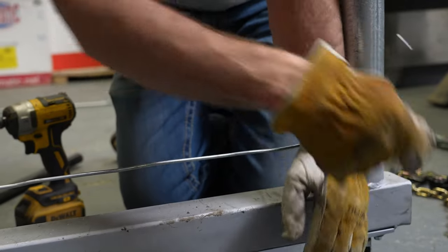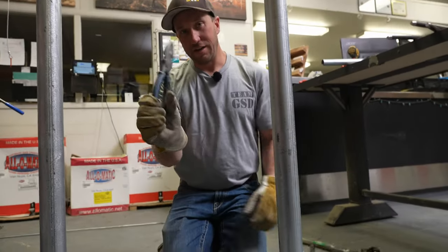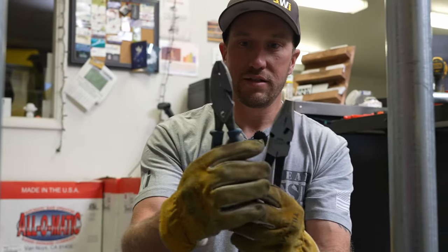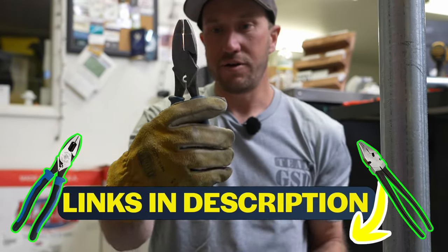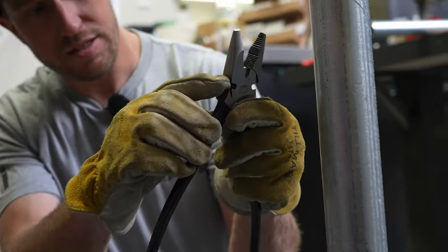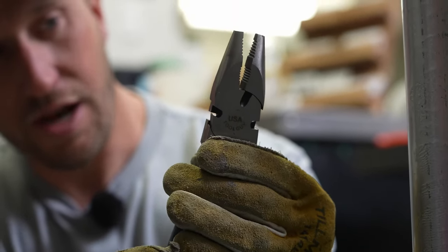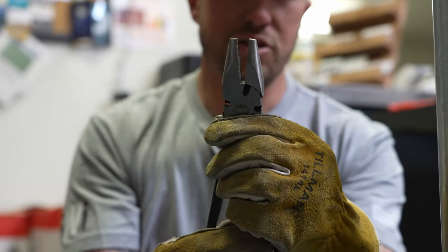This is a seven gauge tension wire. Klein nines — I like those for cutting. Another favorite, these kind of pliers. On the Kleins, everything's all in this jaw right here. On the very bottom you have a bonus tool and you have a crimper. These ones on the side, that's where you're going to go ahead and cut. As you come down you're causing that pinch and the cut action right there, and then you have two places of jaws to grab onto.